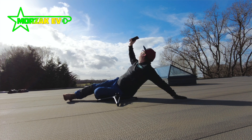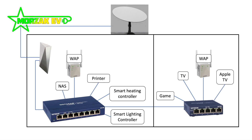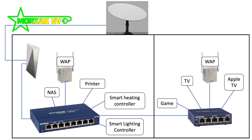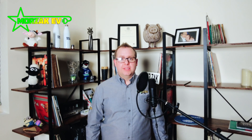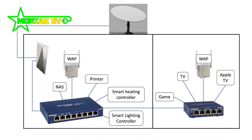It's a simple matter of running the cable down the wall through a hole we made, into the power block. The router runs off that power block as well — it powers the router, powers the dish, and sends the signal from the dish to the router. The router has an input port already plugged in, plus an auxiliary out. We feed into a gigabit ethernet switch in our office where the Starlink router is placed, which then feeds another gigabit ethernet switch in the living room for things like the TV. We also have wireless access points. It's a neat setup and it's been working really, really well.